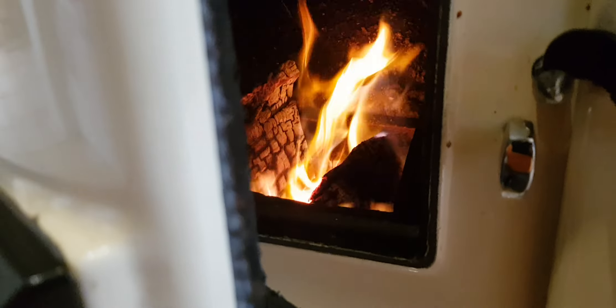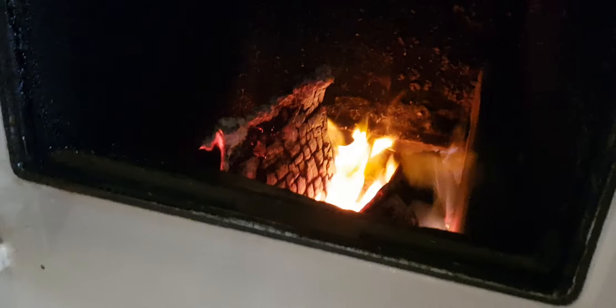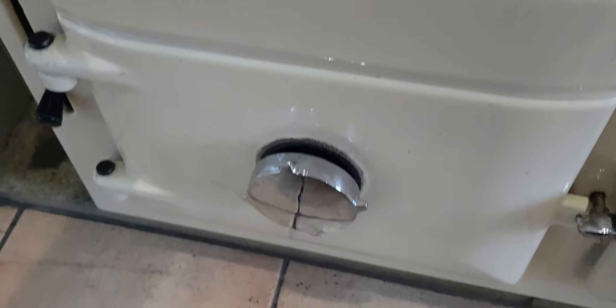You need air - you must have air. If you haven't got air, you won't have any combustion. So let's turn it on - there it is, full. Watch what happens - that's on cooker. Flames just come up. Let's open the damper now - it's fully open, so this now has got full air going up through and up the flue. Put it in the middle, so it's going both ways. Look at the flames.